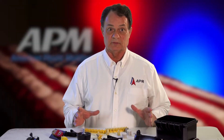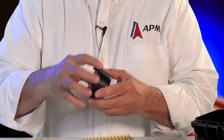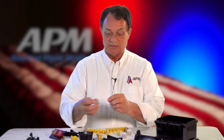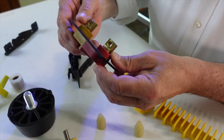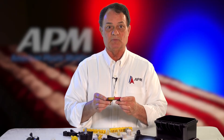Not only do we do a lot of large part molding and assembly, we do small parts as well. We insert mold plastic inside plastic, a gear over a metal shaft, a bronze bushing that's overmolded in plastic. And here's a really good example of two different types of plastic, two different colors, two bronze brass inserts, and a metal plate all molded into one part.